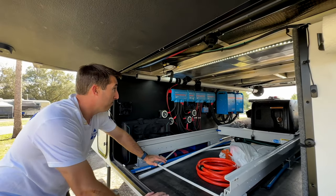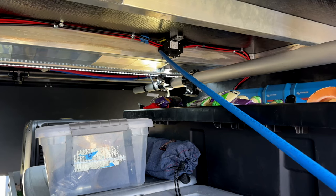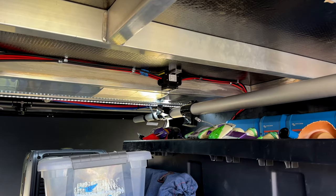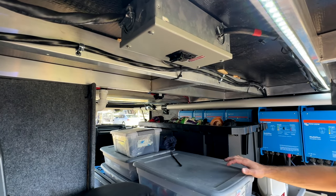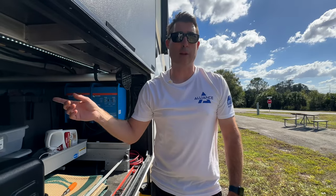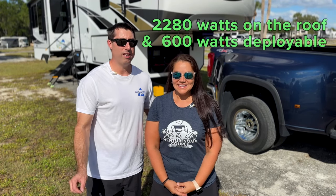These are the PV cables or solar panel cables coming off the roof, set up on 30-amp breakers — every single panel, positive and negative, on its own individual breaker. We were very serious about safe operation. This is our 50-amp breaker for the 120V house power — the ins and outs from the inverter go into the box, out of the box into the breaker panel behind the wall. We can turn off every aspect: disconnects on the battery, breakers on every PV wire, and breakers on all power wires — 100% everything is either fused, broken, or both.